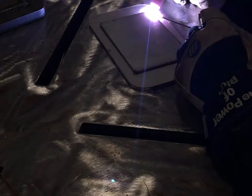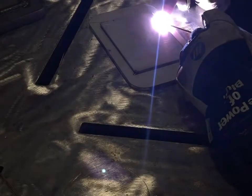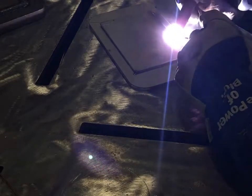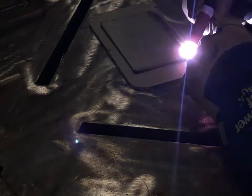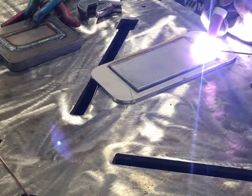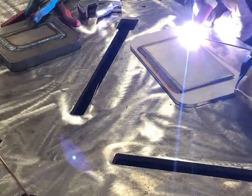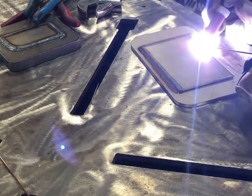Here I'm running a stainless steel lap on a little bit thinner material using a 309L rod, 3/32. Probably a little over 100 amps or so. The only thing I wish I would have changed is using a bigger nozzle or a lens body just to get a better gas flow. So they are turning out a little bit dark, but that's an easy fix.